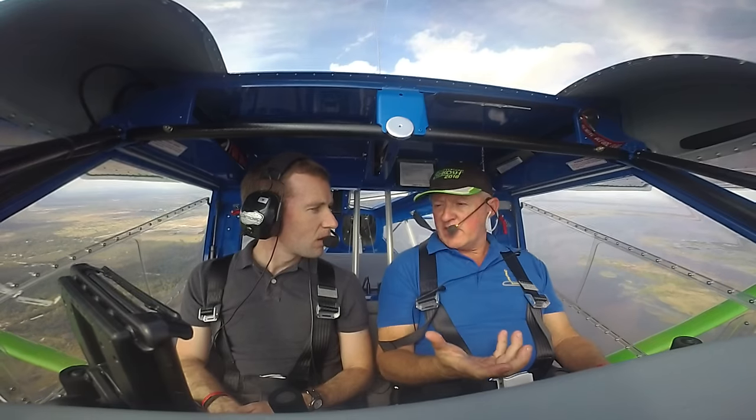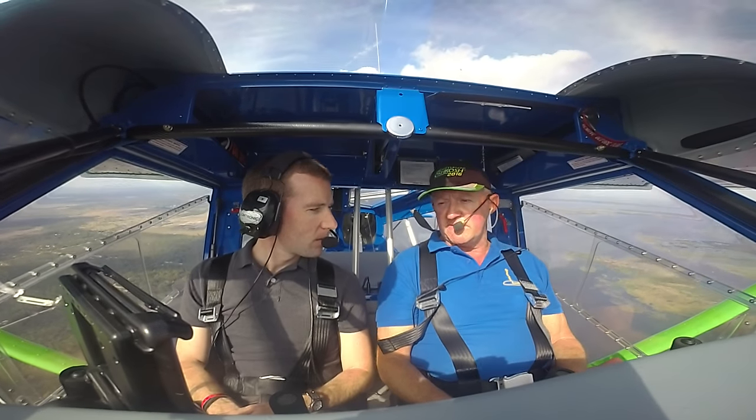It's one of the best flying in the light-sport market. It's not the fast one — it's a slow one. Take-off and landing is 35 to 40 miles an hour. Stall speed with flaps is 30, which I'll demonstrate here in a little bit. Clean, it's 40 miles an hour, which is 35 knots.